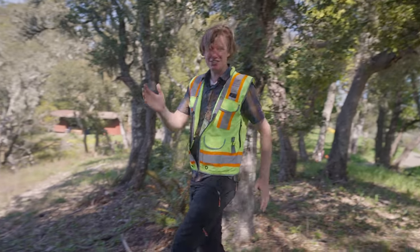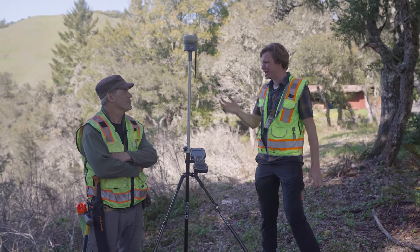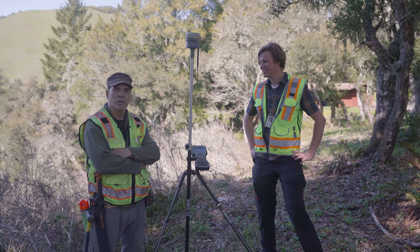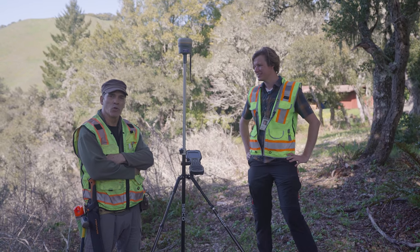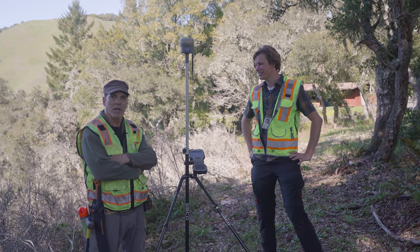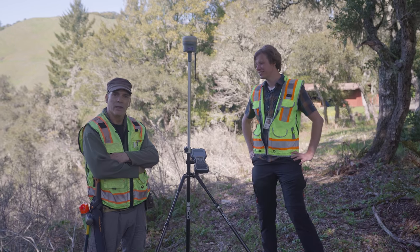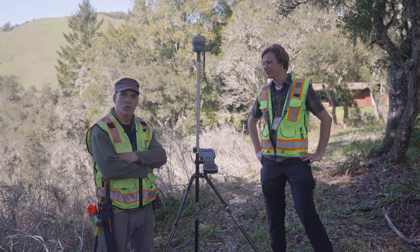So today we have a licensed land surveyor here. This is Thomas Terwilliger, professional licensed land surveyor. Thomas, what are you doing here today? Well, I'm excited to be here. I'm a California licensed land surveyor, and my job is to conduct the control portion of our aerial survey. We have about 20 ground control points throughout the site that we are going to measure with survey grade GPS, so that we can tie together our ground control with the LiDAR data and minimize errors and have a more accurate digital terrain model.